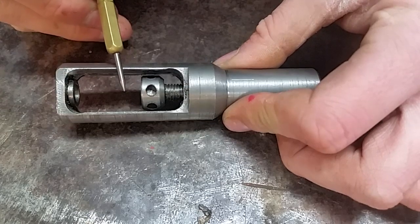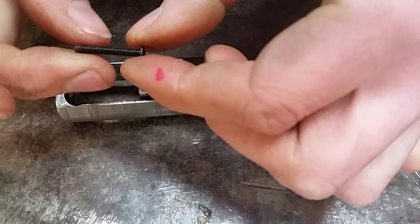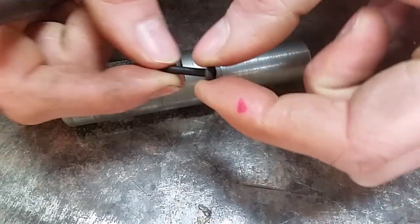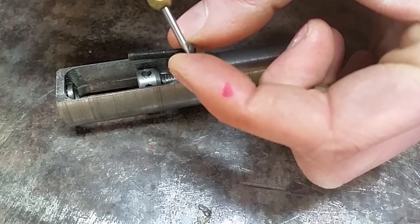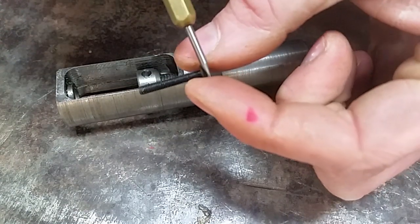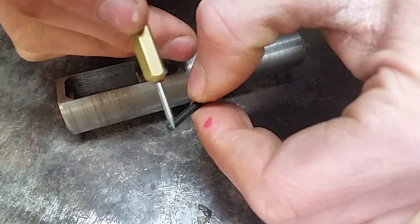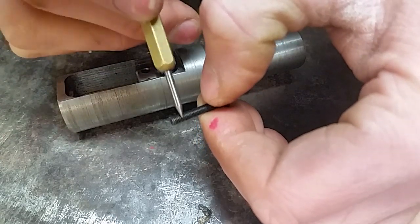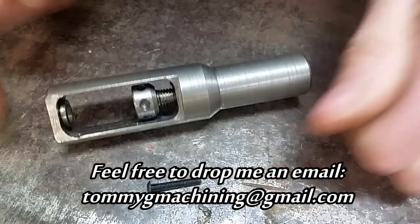Some of you would be looking at this and thinking why would you bother - just use an angle grinder or a bench grinder. The real advantage is when you've got tiny screws like this with funky domed heads, there's no real convenient way to hold on to it if you want to cut the thread off. Even in your bench vise, if you try and hit this with the angle grinder it's just going to spin on you. So being able to clamp down directly on that head is a big benefit. You can put this in the lathe and change the tip - if you want a cone point, if you want a rounded tip, you can choose the type of point you want on this quite easily. Anyway, one day build. Thanks for watching.